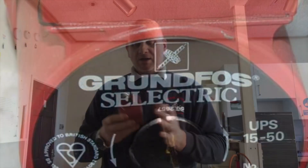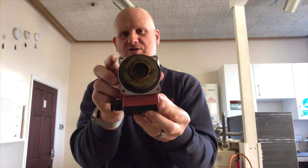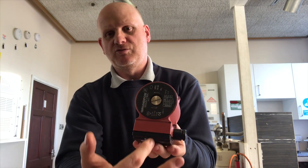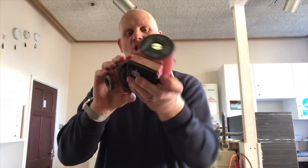One of the main things to be aware of when installing is that the electrical connection shouldn't be sat at the bottom, because if you remove the bleed screw the water would run down into the electrical connections — and that's not a good idea. Because we can move the head in four different directions, it doesn't matter which way the pump body is installed — we can always undo the four screws and rotate the head into any position we want.